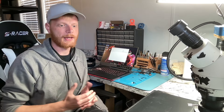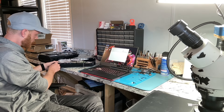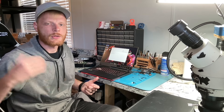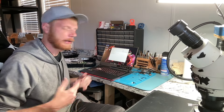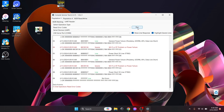This was my problem — I was setting it up just like this and it was not working. One key thing I was doing wrong: you actually need to plug the console into power. So plug the power cable in. Once the console is plugged in, wait a second or two for it to fully power on, then click Run — and you'll see right away it pops up with a bunch of different error messages.